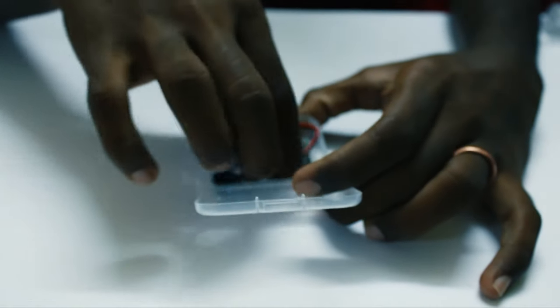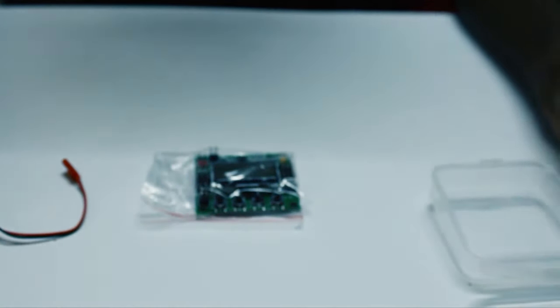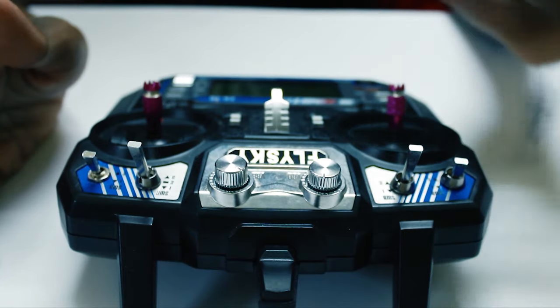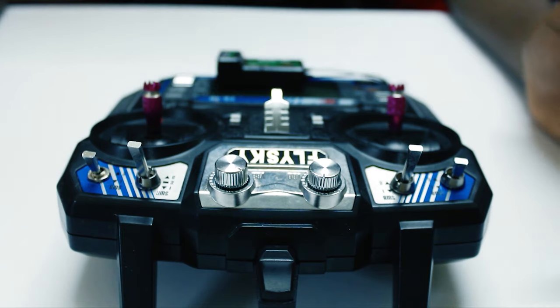Then this is the KK board, KK2.1.5. This will act as a flight controller. The speciality about this controller is that it's very easy to use and it has an inbuilt display. So you can just configure it right on the ground and then fly it. You don't need to connect it to a computer. Then you need the transmitter and the receiver. This is the FS-i6 6-channel transmitter that comes with an FS-iA6B. All the links to the parts will be given in the description section.